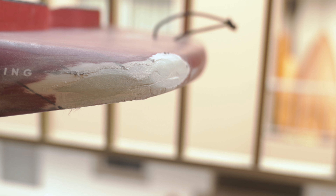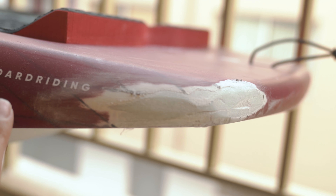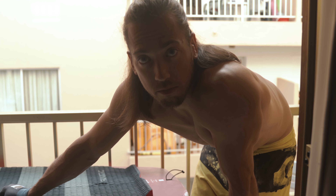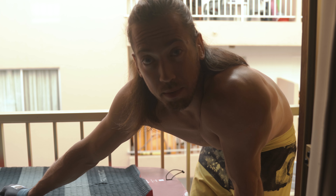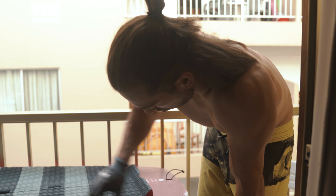Okay guys, so as you can see I sanded it down. On the sides here there is a crack going through the middle, and it continues a little bit to the right side. I wanted to sand to each side of that crack to make sure it doesn't go further along into this area or right here. So I decided I'm just gonna put one or maybe two layers of fiberglass with epoxy on top around all this corner.